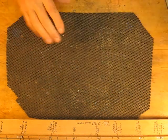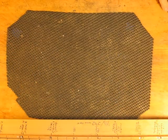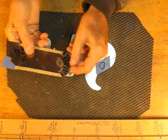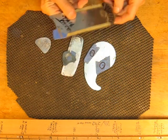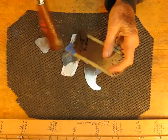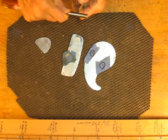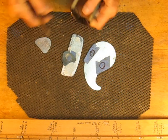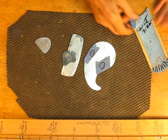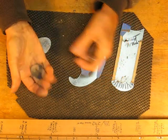The second segment of tuning the top and back plate requires a few extra tools. This is a collection of scrapers where you've rolled the edge into a rolled plane. You have a special kind of steel, and these work back and forth with a very hard steel. You work over an edge, and that forms a little curl — that's what you scrape with. When it gets dull, you just add another edge to it. These are some different shape scrapers.